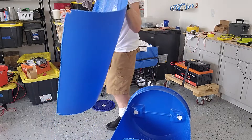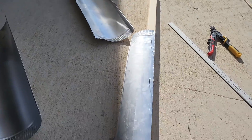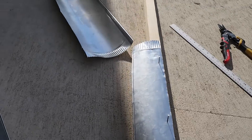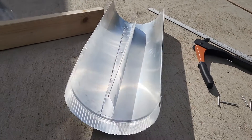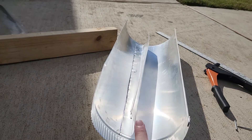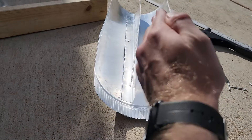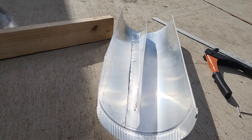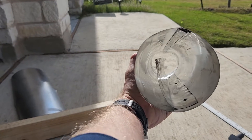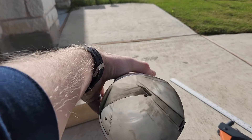And there it is. So I've got my rivet gun and my aluminum. What I've done is I've created a fin in the middle, so when I curl the edges up there'll be more surface area for the heat to come across, just like a heat sink. It's not pretty, but I've increased the surface area for the hot air to go across.